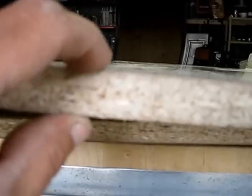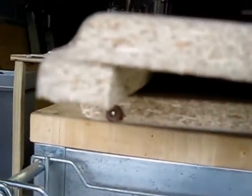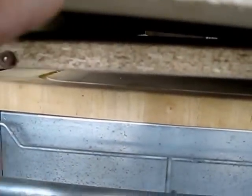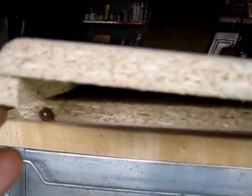If you try to put the countertop on top of your cabinets, one of two things: you could punch a screw through and pierce and damage the laminate underneath. The other issue is the carryover lip would actually come down and possibly interfere with drawer operation, and therefore this would come down too far and impede the drawer operation.